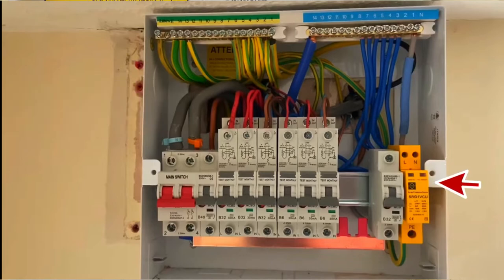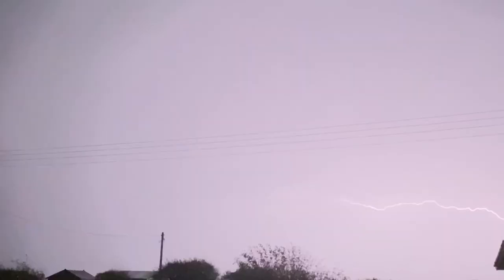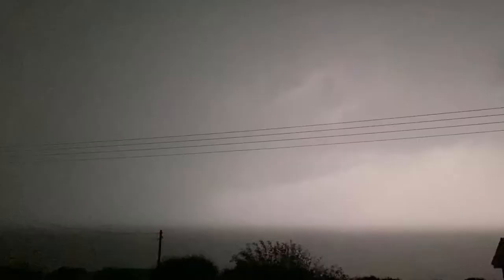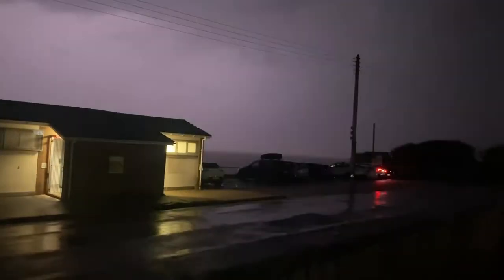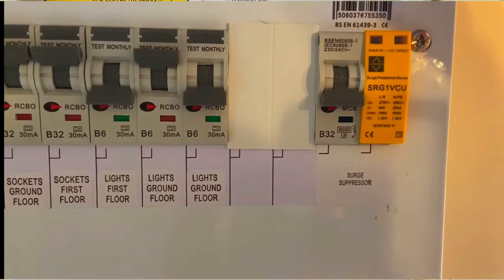The SPD's job is to protect from those over-voltages. They can be caused in a couple of different ways. A transient over-voltage can be caused by atmospheric conditions — such as a storm, a lightning strike, or an electromagnetic storm somewhere in your town or village. By the time it gets to you it's an over-voltage and that can cause a problem. That's probably not quite as common as the other cause.